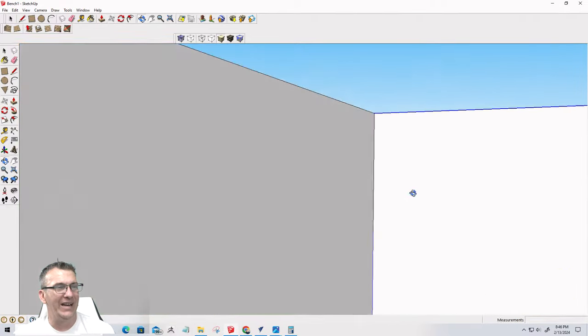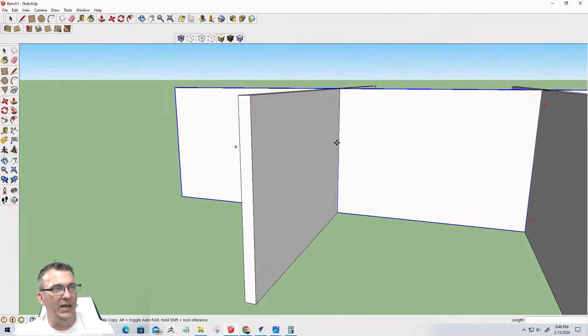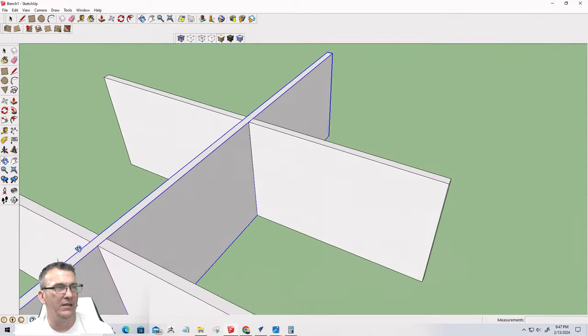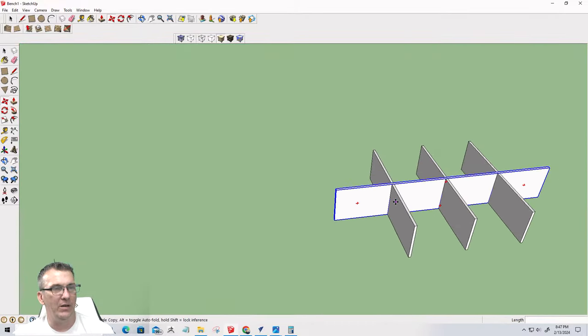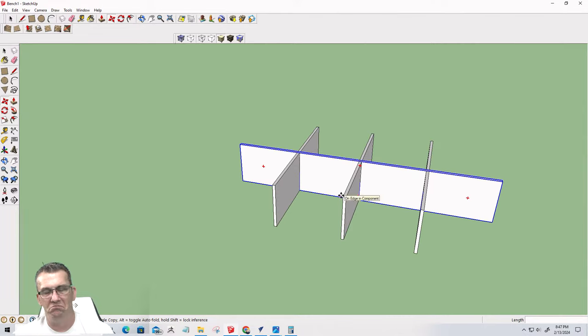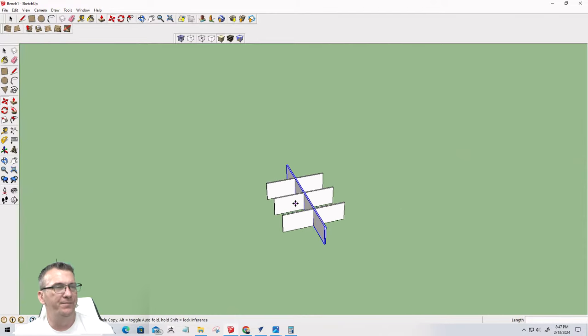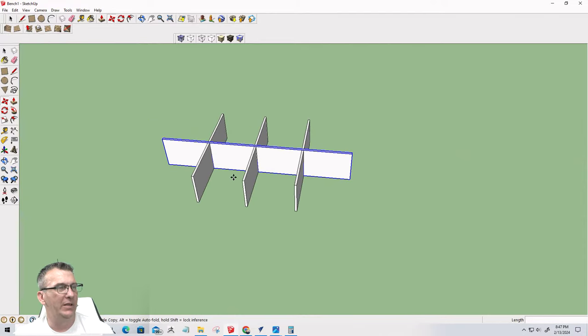Okay, now when I actually cut these out and everything, I'm going to use the CNC, but I'll need to put in my fillets, my T-bone fillets and everything, to give the router bit a place to escape and all. I could very easily do this joinery with a jigsaw, a table saw, a bandsaw, a router bit, and a handheld router, but I'm gonna use my CNC. So that's what we're gonna do.